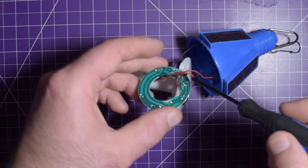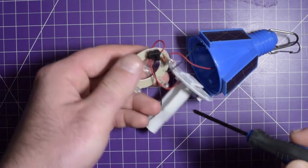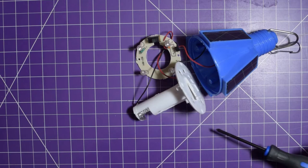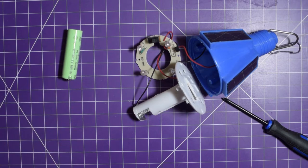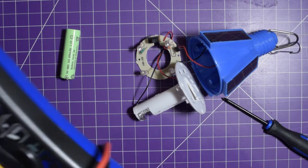Oh, switching the battery positive. That's battery positive here. Because I don't think these LEDs would light at the 1.2 or 1.4 volts maximum on this battery. Let's take a look. I can grab my multimeter here. We'll do a diode check.